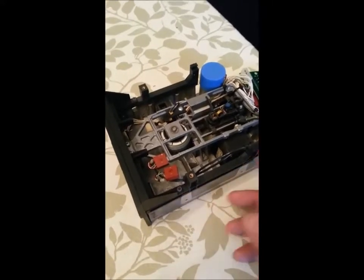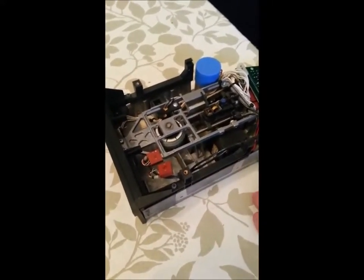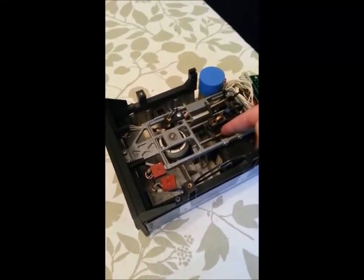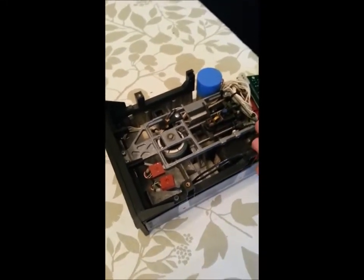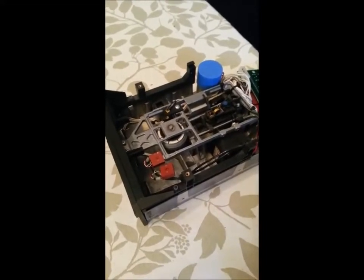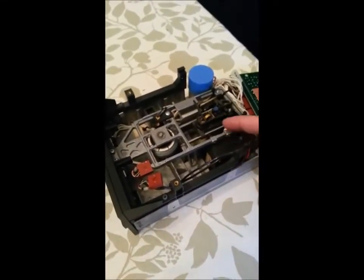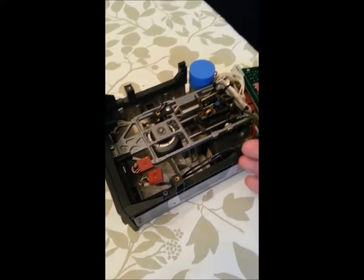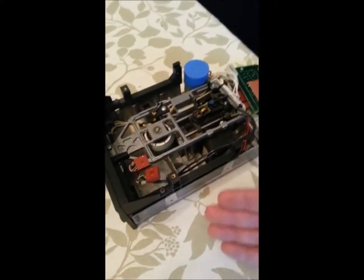There are some key parts that will cause the floppies to fail. Obviously if you hear any crunching or really loud robotic noises while the drive is operating, you're going to have issues with the track system. If you continue to have those issues, there's a good chance this drive was set on top of a system where the heat damaged the motor, and unfortunately you won't be able to repair that without additional parts.